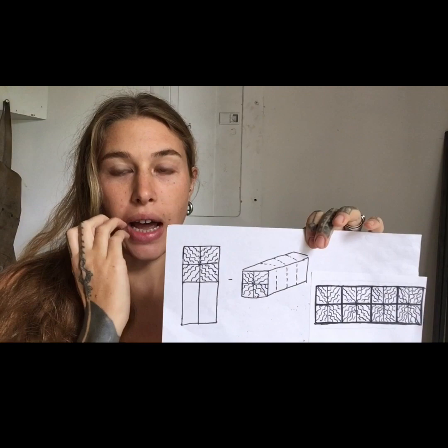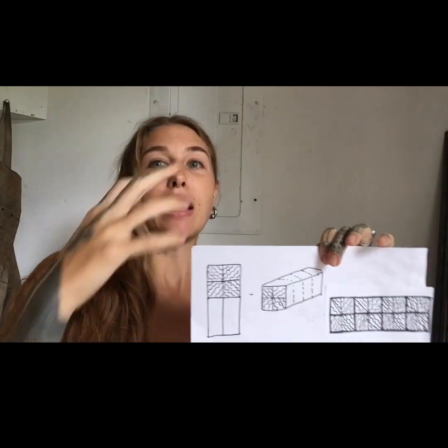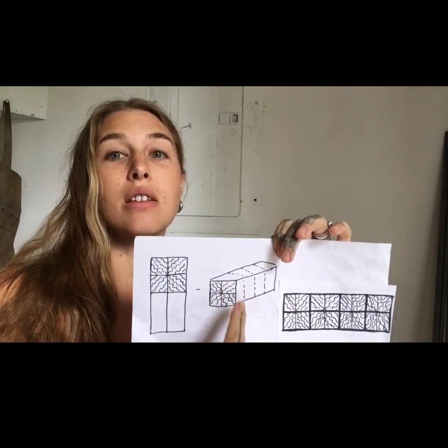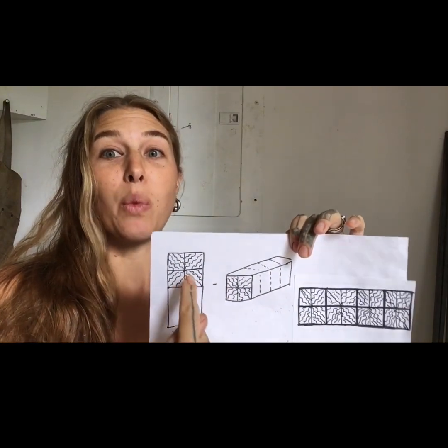After you have this four-way drawn out into another billet, you can keep cutting it and then welding it another four ways — it all depends on how intricate you want your pattern. For this particular billet, I stopped there and did my tile weld. But if you want, you can cut this into four sections and go back and weld it again. When you make a knife from this billet, the more you press down on it, that pattern is going to spread out. This is why people will usually keep four-waying it — because they want that intricacy in the pattern.